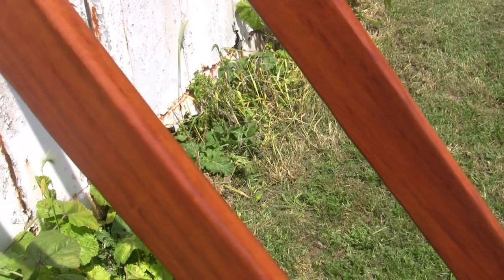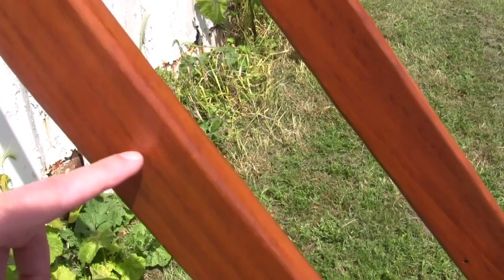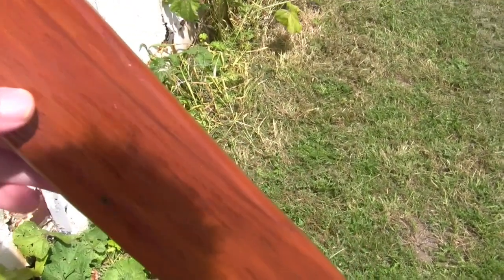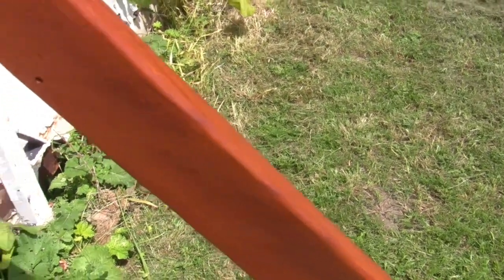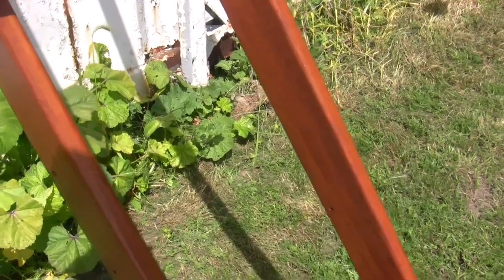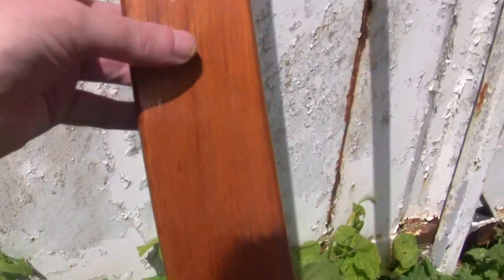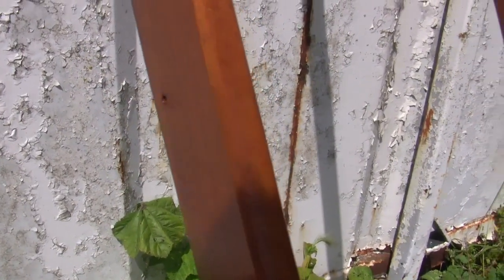So these have had — the minimum is supposed to be three — I think I've done five coats. This nearer one has actually turned out much nicer than the other one. That one was a bit dribbly because this surface was vertical when they were hanging up. Vertical varnishing, I've discovered, is not necessarily a good thing. I'm very pleased with the finish overall, but what I'm going to do to get them a bit smoother is give a sanding off at the top once fitted, then do another couple of coats for a nice flat finish. You don't have to sand between coats, and because it's half oil and half varnish, it takes ages to dry.